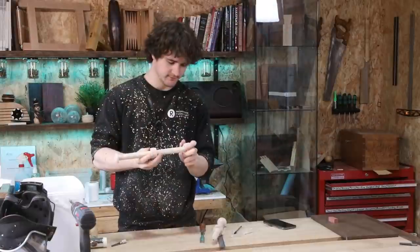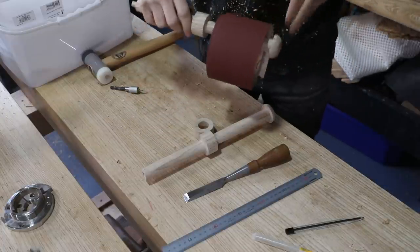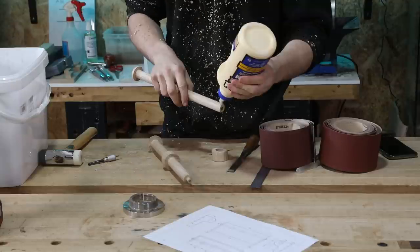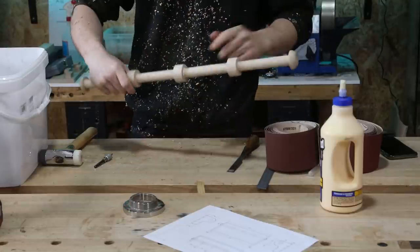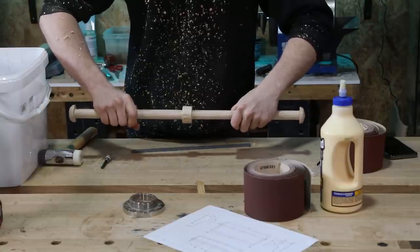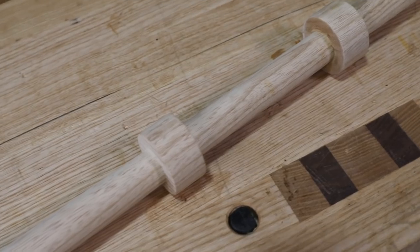Right, and here we go. Could have just bought a longer lathe, but that is satisfying — very satisfying. So essentially the idea of this is to put various sandpapers on here that'll all slot together with that internal divider. That's alright providing the sandpaper behaves itself. Now we'll pop a little bit of glue on it — a little bit inside the mortise and then a bit around the shoulder as well. Hopefully this won't be as tight as it was on the mallet. I've just got to get the distance between here and here correct and shift that sleeve accordingly. I also need to make sure the grain direction is the same, so you can't really see that join at all — a long straight grain carrying right across and then the crown cut patterns on that face.